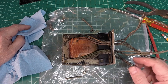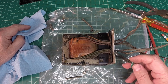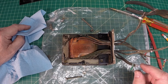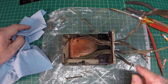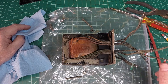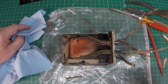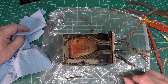I think I've got room up in here for some of these wires. I may not do all of them, but the leads were a little short on this transformer also. So I may go ahead and take advantage of cleaning this up — splice everything back up in here, put some heat shrink on, run some new leads through, and just make sure I've got 8 to 10 inches or so. That way when I do my lead dress and get the power transformer back in the radio, I'll be good to go.